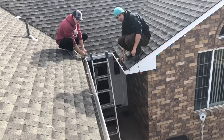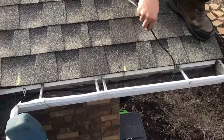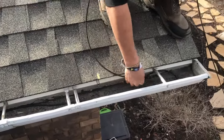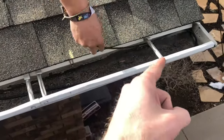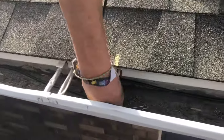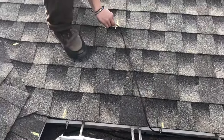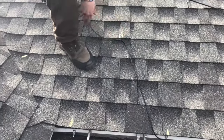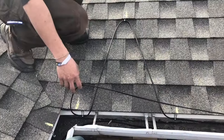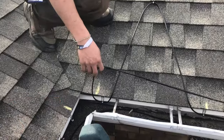We have just enough. Once we have the gutter system laid and all the cable in there, we're now going to run the cable on the roof edge. Starting this process, we want to make sure that we tuck enough cable coming back in the gutter to the end so we don't get freezing up along this area. Then we're going to come to our first clip, set it with the cable in the clip, and bring it up onto the roof edge. We've laid our first loop on the shortest section. We could run the valley, but we're going to hold off and I'll show you why in a little bit.